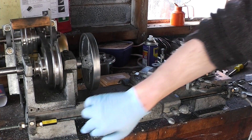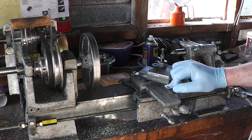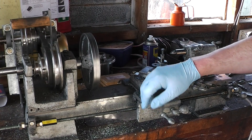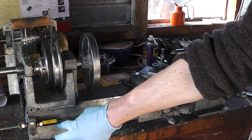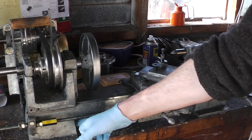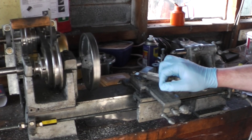For the feet — again, you can just do a simple pop gate on top, and it's even less of a problem with the feet if you get an inclusion, because the top of the feet you don't have to scrape in or anything. I did a gate on the side of the feet because I had room in the crucible for the metal. It's a good dealer's choice.